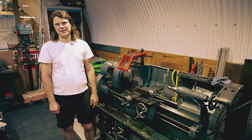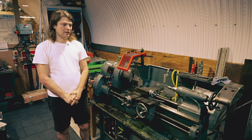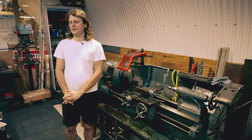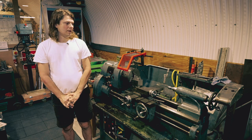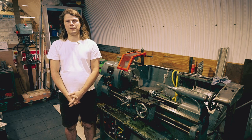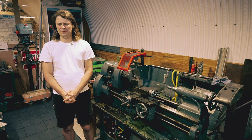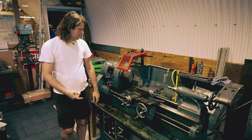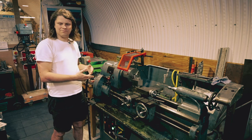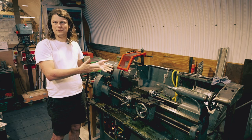How do you talk about safety and health on the lathe? Usually when I talk about safety on the lathe, I start my induction videos with the difference between being scary and being dangerous. There are lots of tools here in the metal shop that are scary and dangerous at the same time. Most tools, like angle grinders, will try to warn you — they are loud, they are trying to escape your hands, they are vibrating, and you have that gut instinct that that thing may be not to mess with. But with the lathe, it's kind of a silent machine. I've turned it on and it does pretty much nothing, and people tend to dismiss this type of threat.